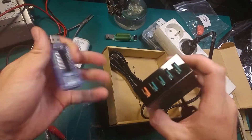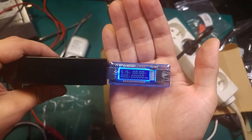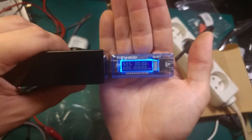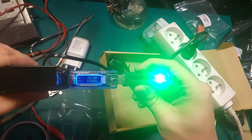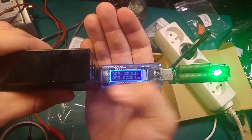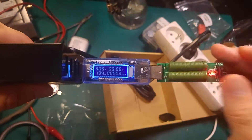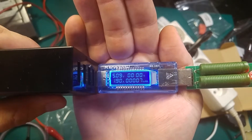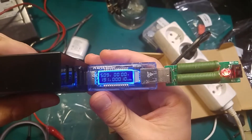Let's do a power-up test and check if we've got power on the output. Let's try the dummy load. Right now we're on one amp and the voltage is okay. There won't be exactly one amp because they have a tolerance, but that's quite accurate. We also got 1.9 amp, which is okay, and the voltage is above 5 volts, which I would say is okay.